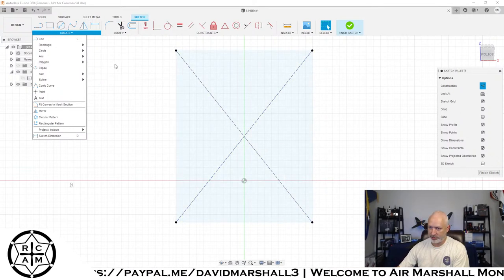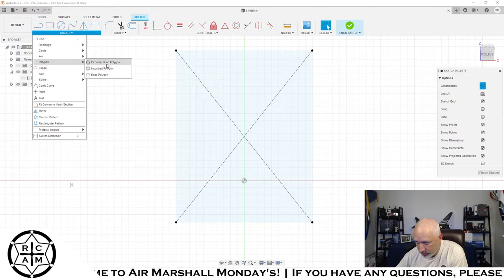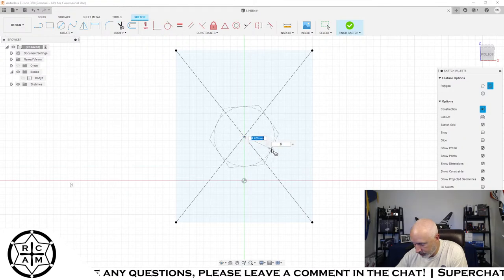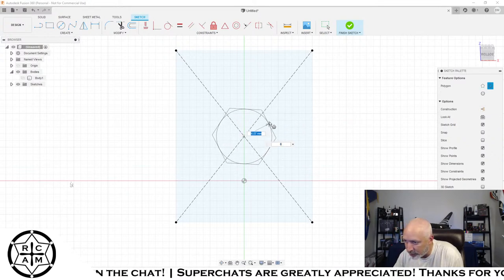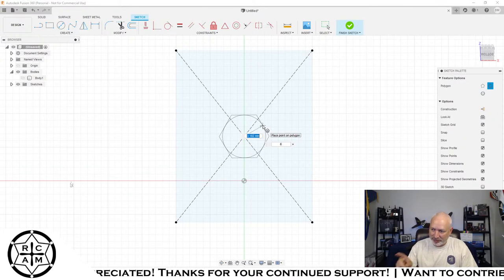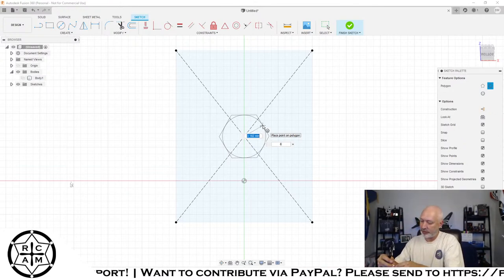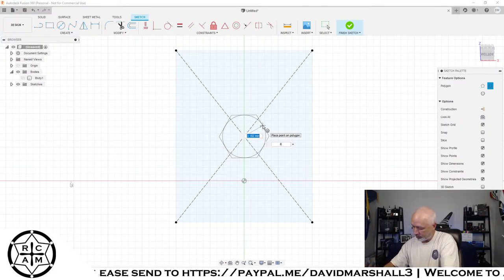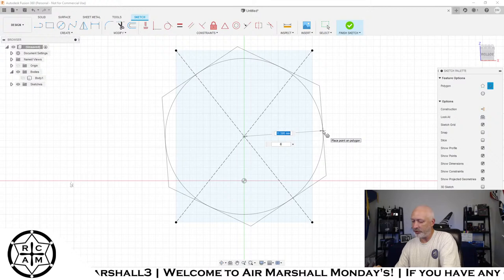Okay. So we know where the circuit is. And we're going to take that off of construction. So basically what we're doing is we're going to create an inset using this polygon shape. We're going to extrude about whatever the thickness is of this SMA connector here on the bottom. When we create this bridged area, we're going to raise that up by 2 millimeters, which is perfect.